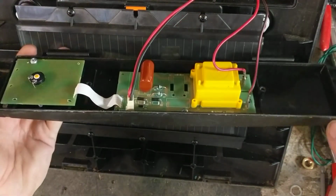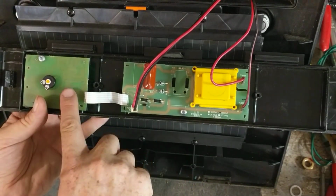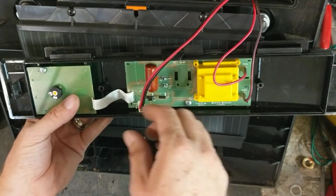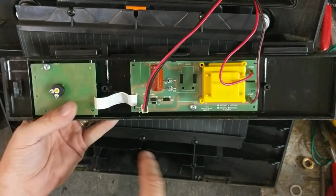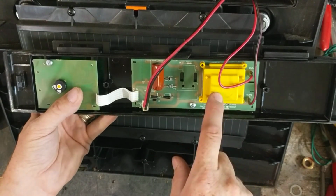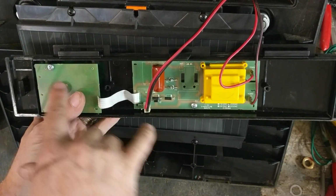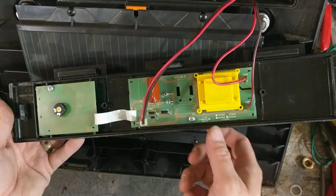And this is the circuit board. It's a two-part board, but if you ever buy a new board, it comes together just like this. If your board's got issues, you can always take it apart. If you don't want to work on the board, you can send us this whole plastic and the board, or take the board out. All of the S50 and S20s have one screw at least that holds this bigger portion of the board. The later ones have a second screw up here to hold this little switchboard in, so you can remove both screws, unplug these wires, and send us just the board, the two parts of the board together as one piece.